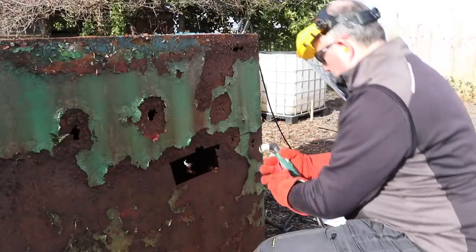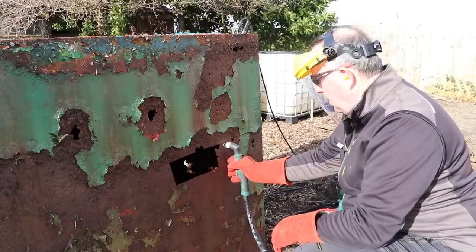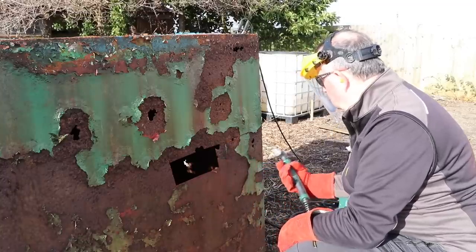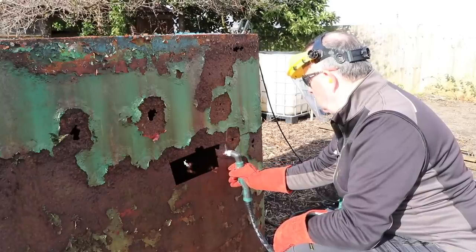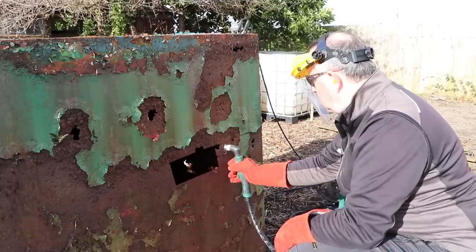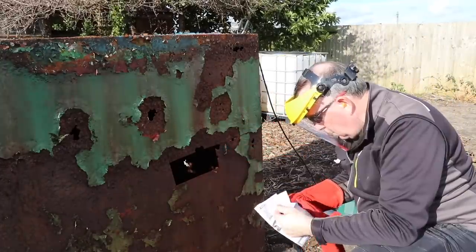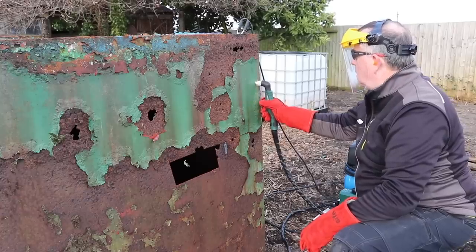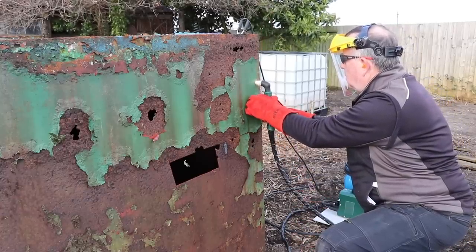Before anyone comments, this diesel tank has long since seen any diesel - it's been in the garden rusting and being rained on for the last 30 years, so absolutely no chance of anything combusting while I try to cut it up. At this point I'm not sure how bright the cutting flame will be, so I just use a face mask and some tinted safety glasses. Although the cutter seems to be arcing with the metal, it's not penetrating through and feels very weak. So after a quick read of the instructions, I increase the air pressure and give it another go - this time I actually cut all the way through, although it's still struggling and very slow.